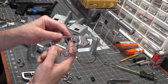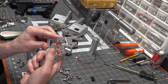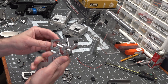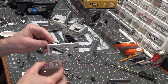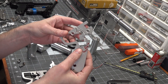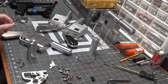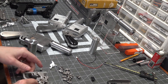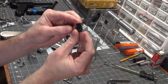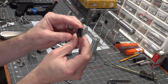The first thing I had to do was figure out how to get a trigger switch going. One of the problems I was worried about was creating a system where you could pull on the trigger really hard but it wouldn't break a switch and would be pretty reliable. The switch has to fit in a pretty thin area — less than a quarter inch thick. What I ended up finding was a bunch of these little micro switches, and the nice thing about those is no matter how hard you press on them, you can't really break the switch.